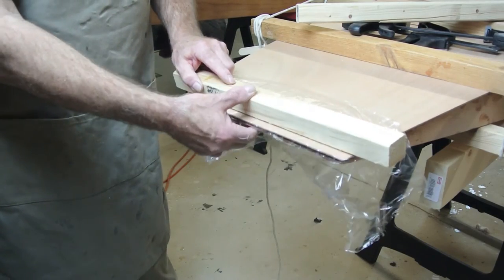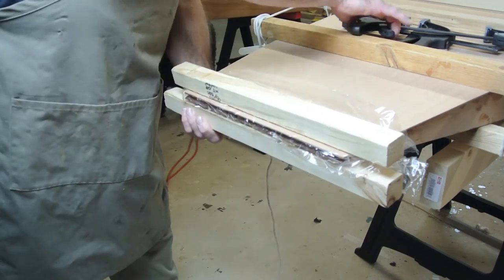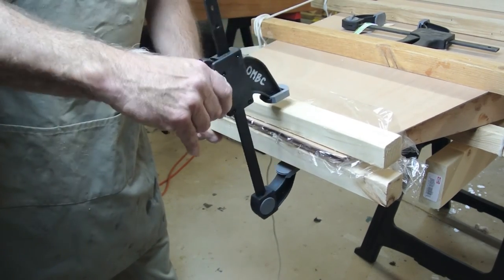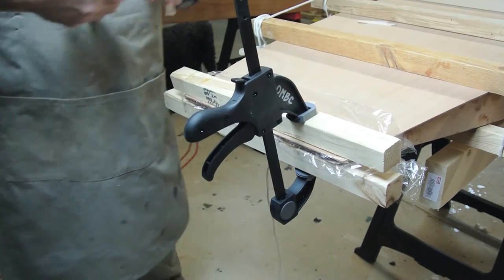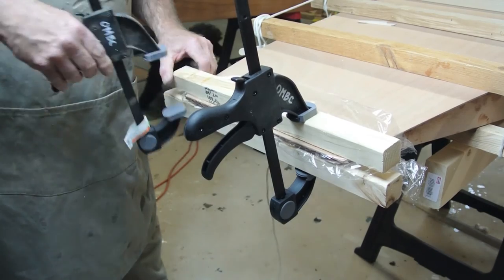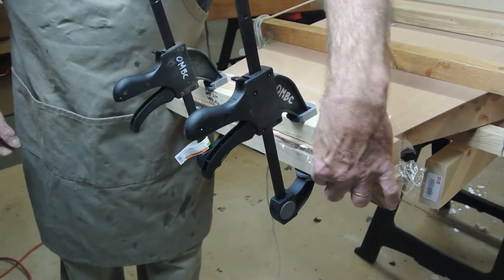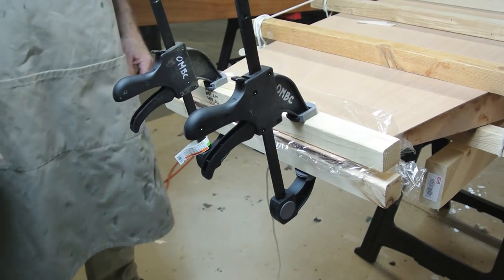Wrap a layer of plastic wrap around the transom and set a pair of boards across the back edge, one under the transom and one on top of the deck, centered over the transom tapers. Use some bar clamps or C-clamps to apply enough pressure to force the deck down onto the transom taper blocks. The plastic wrap will catch the epoxy that squeezes out at the transom.